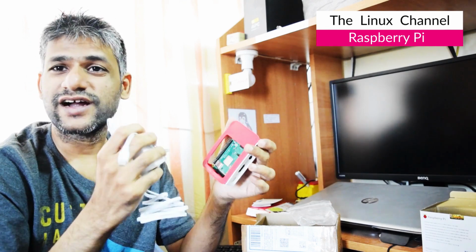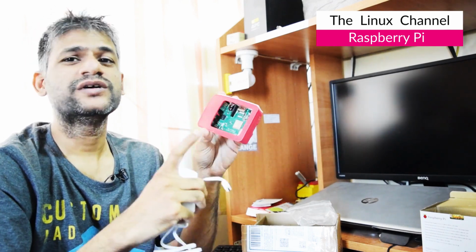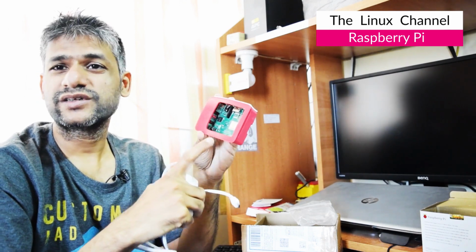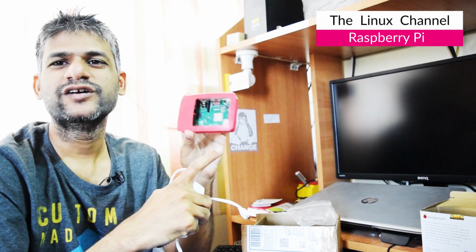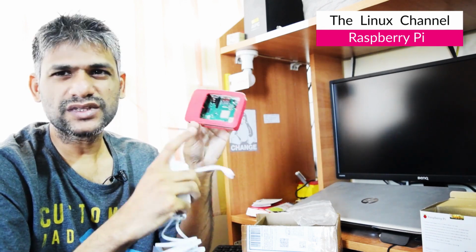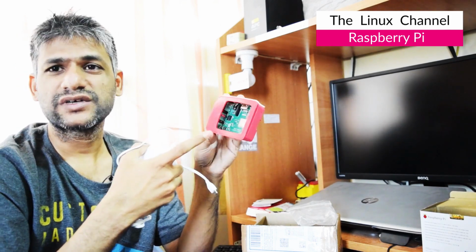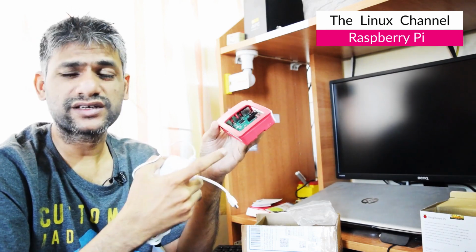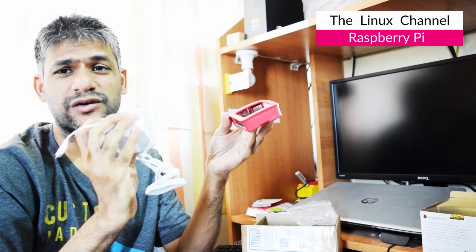The reliability starts from the power supply, and then next it is all about the board itself. So if your board is crashing or something, it is not reliable, don't suspect it is the kernel doing that or your applications that you have written. Start debugging from that source. Let it be the power supply or some type of connectors, or those GPIO connectors or some wrong connections. So do it step by step, but don't ignore the power supply alone.